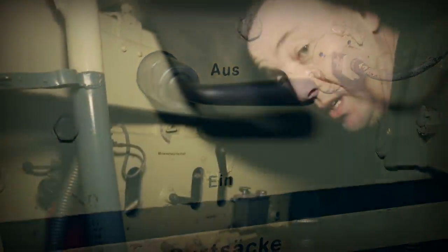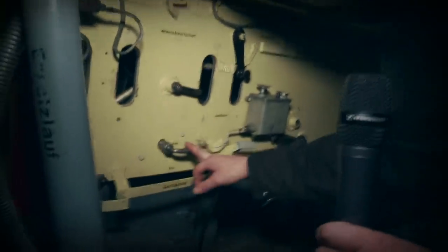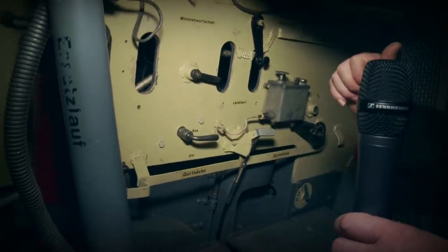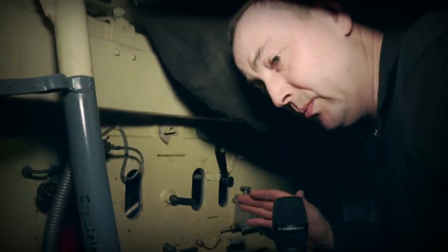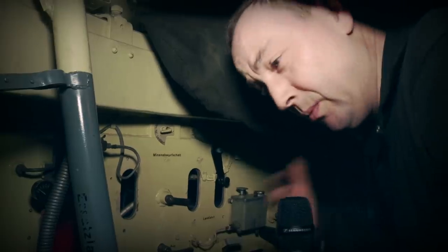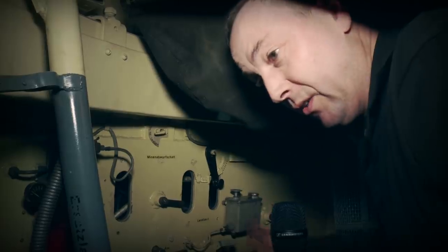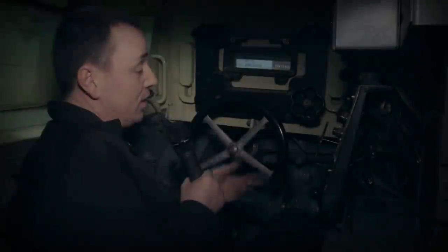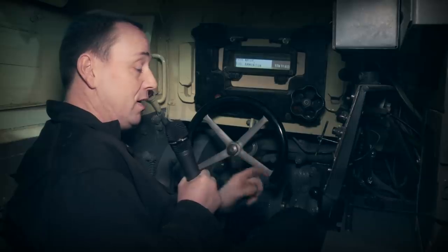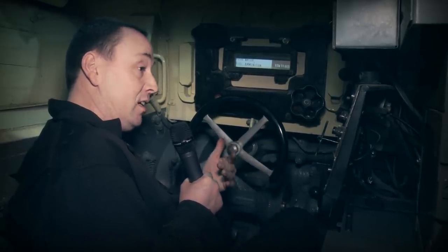The main switch of it all is the master switch — the main power. Once that's initiated and turned on, it's down to the driver to start the tank. If there's any problem — whether there's a suspect fuel leak or fire — you turn the master switch off straight away and kill the fuel. That's why when we first parade and start the tank, you always have two or three people with you for fire watch and safety. So if we take it from the point where the master switch is on and the fuel is turned on, the next step is to start the tank itself.